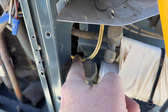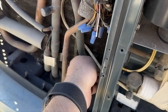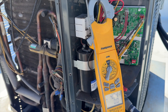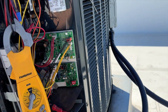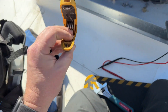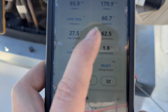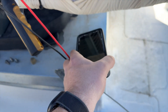It's not really putting out warm air. Suction line is pretty warm, true suction is also warm, so I'm going to suspect we're low on charge. It's about 50 degrees, so we're going to have to do a low ambient guesstimation. Our subcooling should be about 10 on this unit. I'm putting a thermometer here just to get a more accurate reading. Only one of my clamps is working, so we need to get some batteries for that. I'm getting my subcooling reading currently at 1.7, so the refrigerant charge is definitely low. Suction pressure is low, head pressure is kind of low.